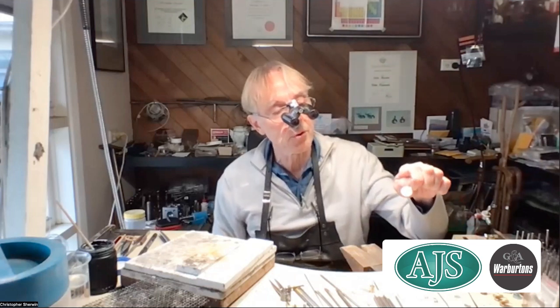Indeed. So when you say it's a production item, what do you mean by that? So these ones I've made for about 30 years, and I think the first 4 or 5 pairs I made, everything was by hand. And then I decided I'm going to make a particular size and style, and I'm going to make a master pattern and mold them and cast them. So the lower sections of these, I have a master pattern for them, and I cast these in various alloys, gold and silver.